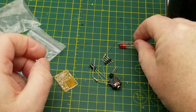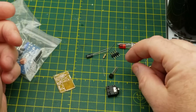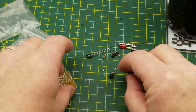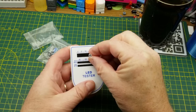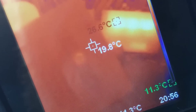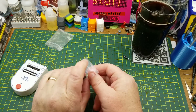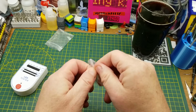We have a couple of LEDs — a red one and a clear one — a pin header, a ceramic capacitor, two resistors, two capacitors, a transistor, and an audio jack. The clear LED: I'm not seeing anything off it visually, but the thermal camera, which sees infrared, can see it — so that is an infrared LED. If this kit has an audio jack and an infrared LED, could that be an infrared audio transmitter?